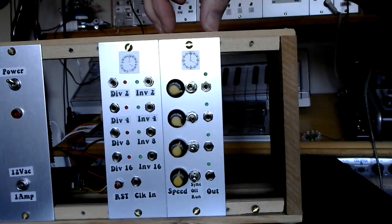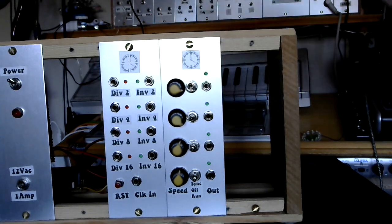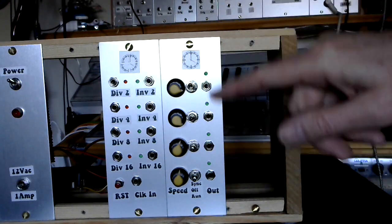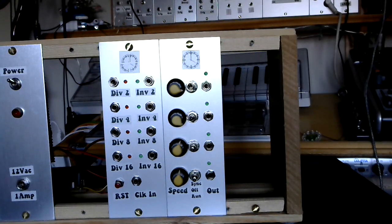For now, I think I've got a multiple clock module that's as simple as I can possibly make it, that will give me the kind of outputs I want. I've shown you the circuit diagram, and in the last video I showed you the strip board layout for the actual clock circuit. In this video you've got the strip board layout for the piggyback board to add the gate buffer onto clock one. If you're wanting to follow this project and have a go at building your own, you've got everything you need — so go on, have a go, why not build your own?